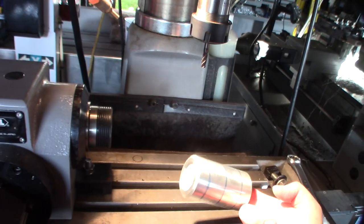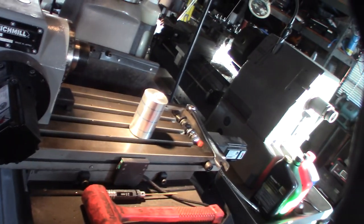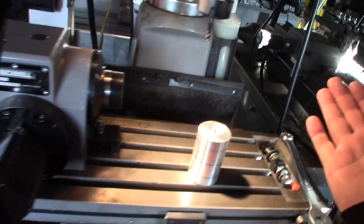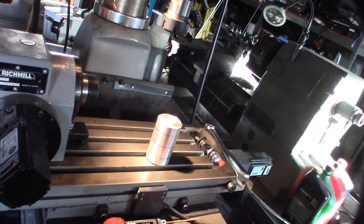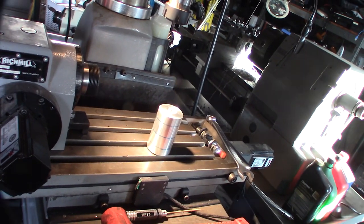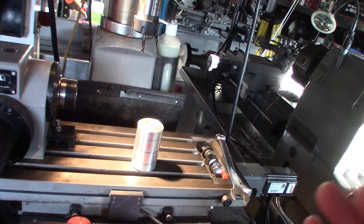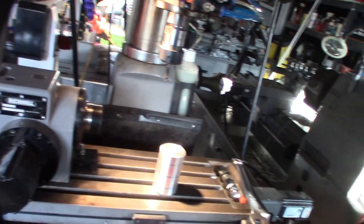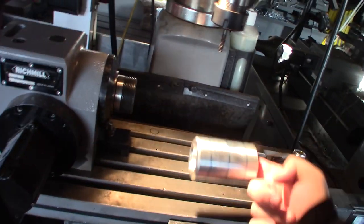All right, let me know what you guys think, if this is a good idea or bad idea. I know that when you bring the radials up, you can increase capacitance. Like I said, typically you see them at 90 degrees or 45. I do have a nanoVNA coming in, so that'll give me much better insight into how these antennas are working. All right, guys. Cool.